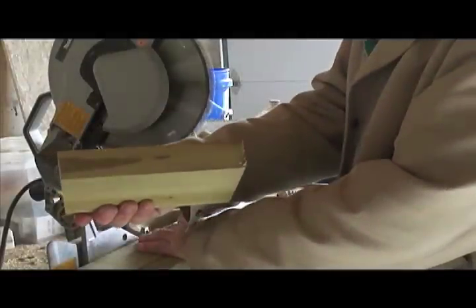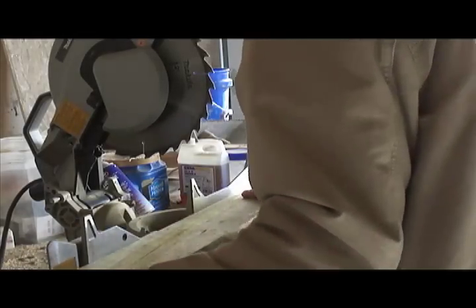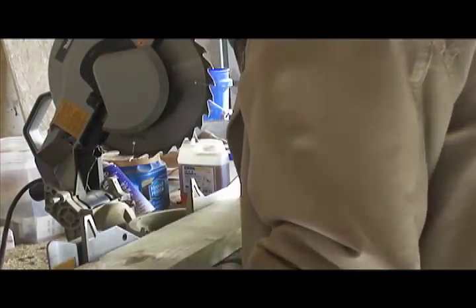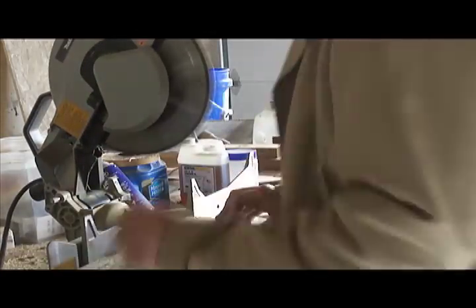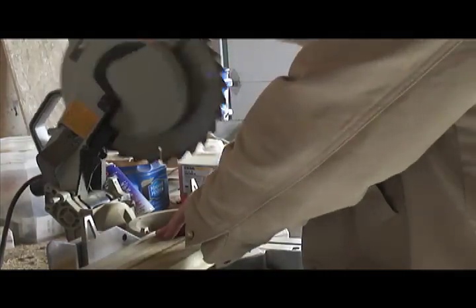You want a trapezoid. Flip. And then I mark the saw at 8 inches. With such a small angle, it's really hard to tell which way the board is cut. By flipping the board each time, you ensure that the orientation of the angle cut is the way you need it for a segmented arch.